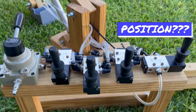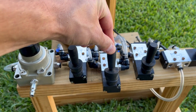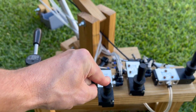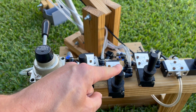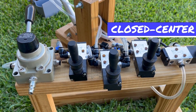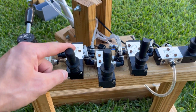Three position is in reference to the control positions. I've got forward, which moves the cylinder one way; backward, which moves the cylinder in the opposite direction; and then center, which does nothing. It's a closed center valve, and you'll notice there's a spring return to center.